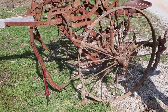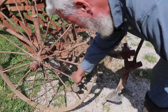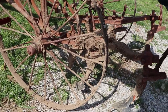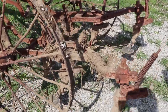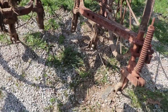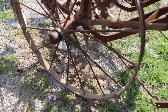This is a cultivator. It's got six knives on it — actually four moldboards, small moldboards, and two knives. It's to break up the soil that I just plowed in big clumps; this will turn into smaller clumps, and then I'll run over it again with a chain harrow and it'll be nice and smooth and tilled up perfectly. You can also use this to do weeding in rows — take off those two front knives and let the back four kill all the weeds in the row.